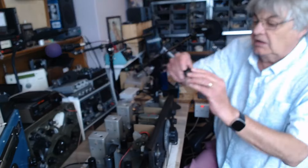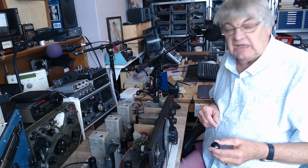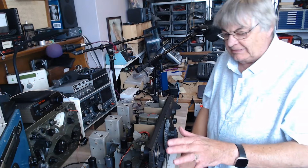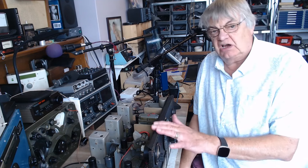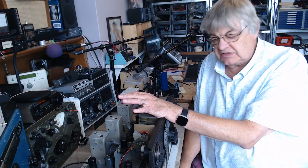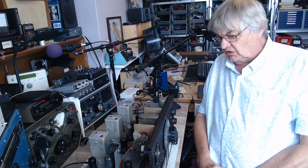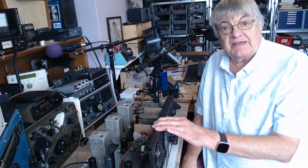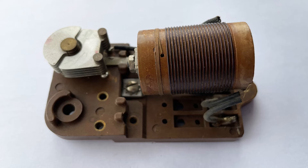I've also ordered a double diode for the noise limiter because the original one went funny when I tapped it. I'm not too worried about the limiter at the moment — just trying to sort out these other problems. I can't find on any HRO circuit a mixer using a heptode like this — it's just not there. So where did that come from? Again, it all looks original underneath. Unless a very professional radio amateur has changed it all — if so, he's done a damn good job.